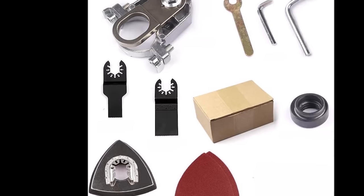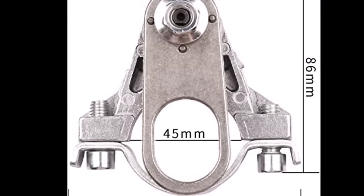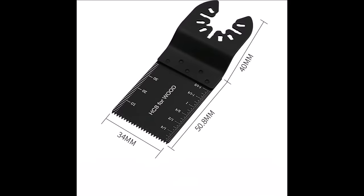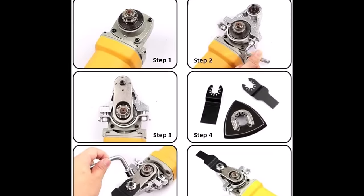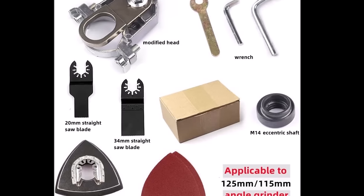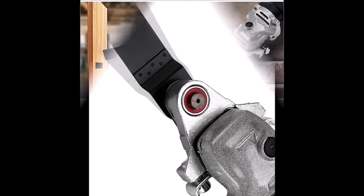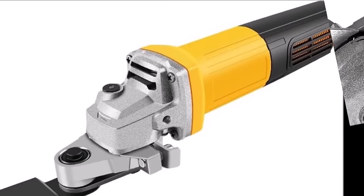Number 11. The Angle Grinder Conversion Universal Head Adapter, priced at $16.90, significantly enhances the functionality of your angle grinder. Crafted from durable steel with flocked sandpaper, it's compatible with 100mm, 115mm, and 125mm angle grinders, and boasts M10 and M14 thread compatibility. Its narrow blade design is perfect for precision work in corners and small spaces, while the groove removal blade excels at cutting thin mortar, gypsum walls, and cement boards. It also serves as an attachment for rough grinding involving tile adhesives, concrete, and soft stone.